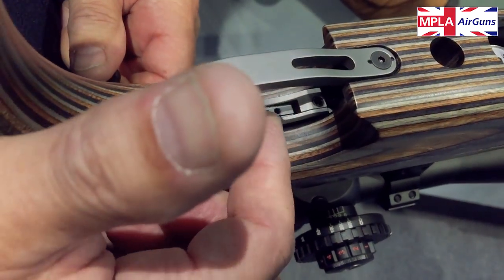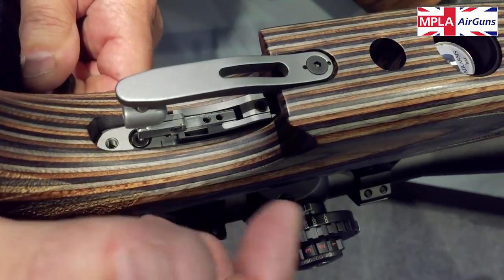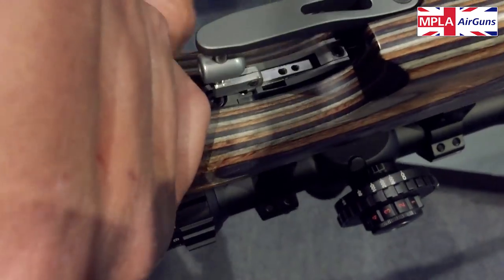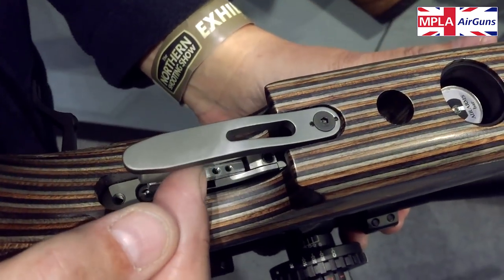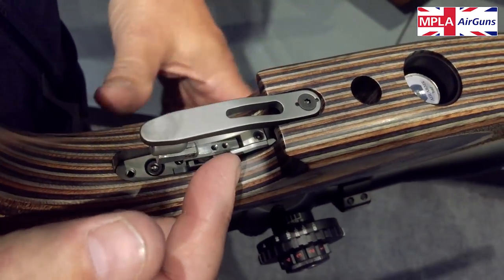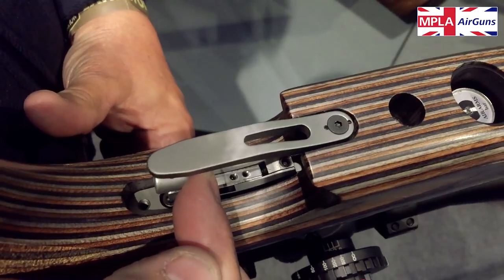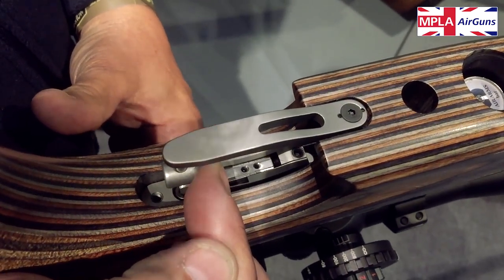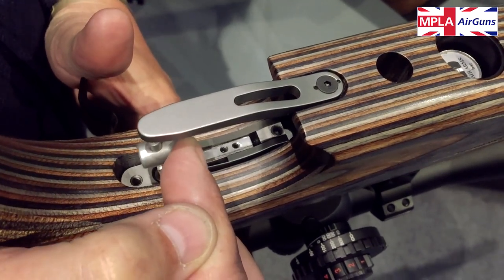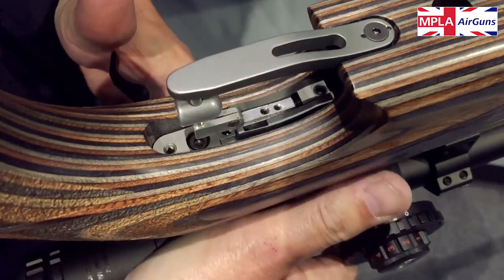But you need to adjust both of those two screws, unscrew it, turning them anti-clockwise, and you'd still get the same trigger release, but instead of the trigger breaking there, on that second stage, it would break the trigger, say, back there somewhere. So after it fired, there would be a reduced amount of movement after the trigger fires. That's one thing you could do.